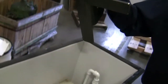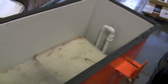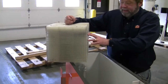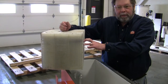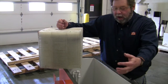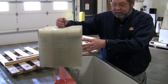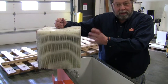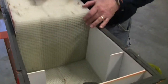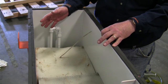Inside the tank there are a couple of things. First, there's this bracket meant to hold the media down, because it tends to float. The media comes in these one-foot cubes. What this does is it enhances oil separation from your water-based fluids — there's a tremendous amount of surface area. All the dirty coolant with the oil in it has to pass through these two media packs, and when it does, the oil particles are attracted to the media, which helps make bigger particles so they float out of solution more easily. These just stay inside normally, you don't have to do anything with them, and they never wear out.